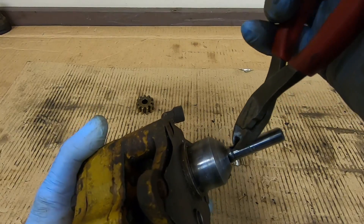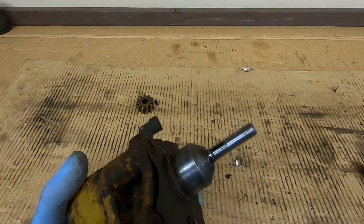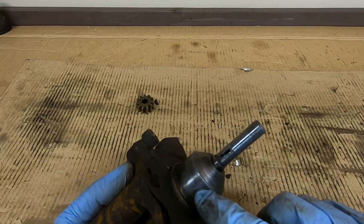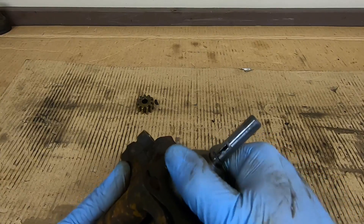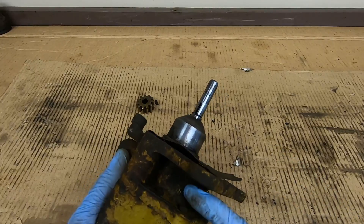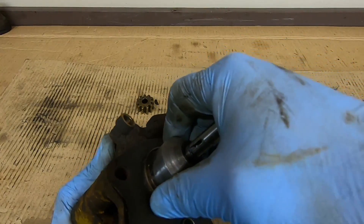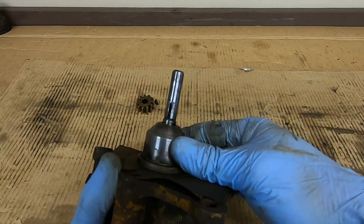There we go — just peeling the small key off the shaft that locates the gear. What's curious now is this cone-shaped piece should already be trying to come off, but it's got some pretty good spring tension on the back side. Maybe that's why the pump shaft doesn't turn, because below this cone-shaped piece there's a packing seal and another packing seal a little bit further in. That spring tension is usually enough to push it off, so we'll have to see if we can loosen it up.